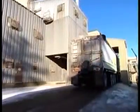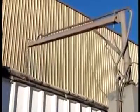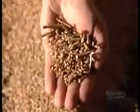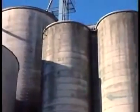As soon as the wheat shipment arrives, a grain probe vacuums up samples from throughout the load. If the samples pass quality inspection, the mill gives the truck the go-ahead to dump the wheat to an underground conveyor. From there, the grain goes into a cleaning machine, where a system of sieves removes impurities such as straws, sticks, and grain dust. The wheat then goes into storage silos until milling time.